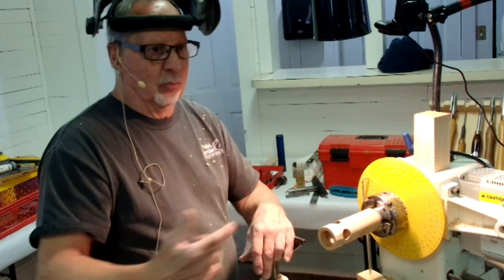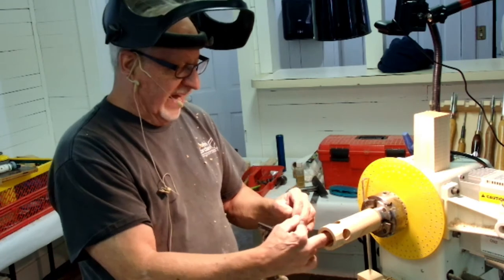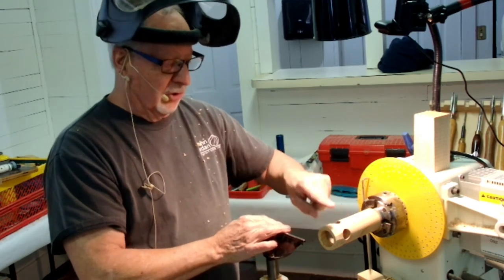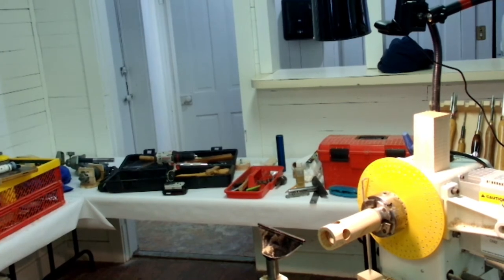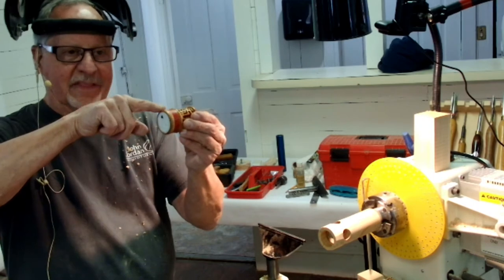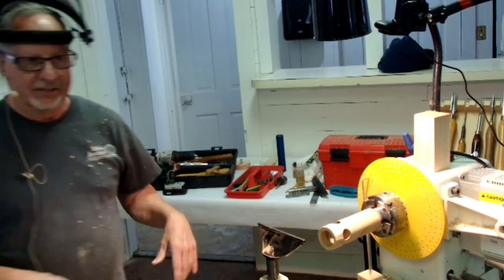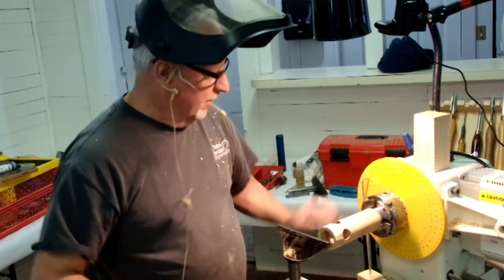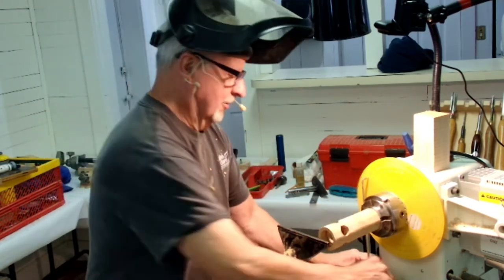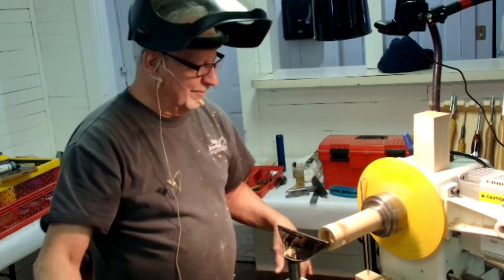Like I say, you could drill one bit all the way through. The reason I do two sizes is I want to recess this area farther than that area. In other words, I've been doing details kind of like this. I want this area to be lower than that area because I just think it looks better. And that's the main reason I do the two sizes. Oh, I'm going to talk to you about that in a minute, but not yet.